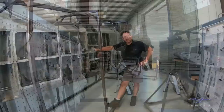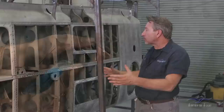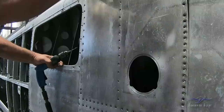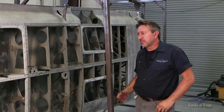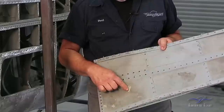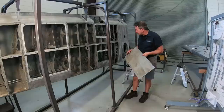The last time we did an update the wing was in the fixture stand, but we hadn't disassembled anything yet. Since then we removed almost all the skins off the bottom of the wing. What we found is a few issues — it's a good thing we're opening it up because the wings are fairly untidy inside. Almost all the paint is flaking off, and there is corrosion inside, but all surface corrosion — nothing too serious. We're finding white powdery spots on some of the skins and in a few areas internally.